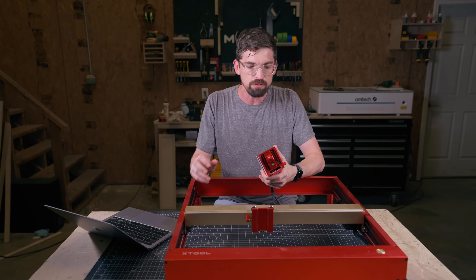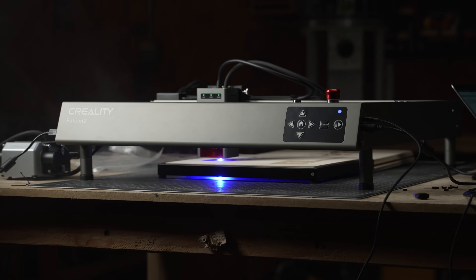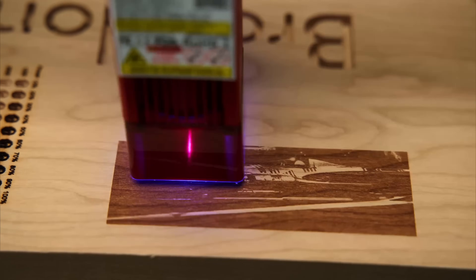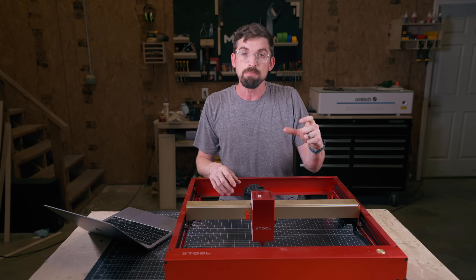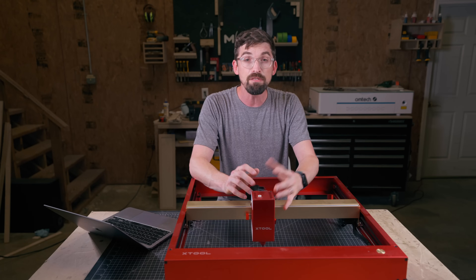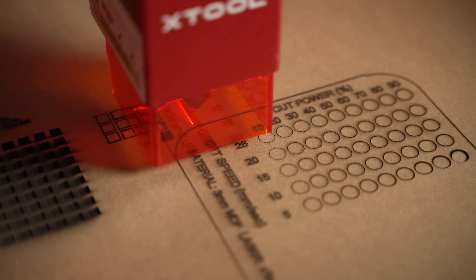You can get these machines anywhere from about 5 watts all the way up to 40 watts. Once you're hitting the 20 to 40 watt range, you're going to go over $1,000. I really think 10 watts is a pretty good sweet spot — if you want to do a little bit of cutting and mostly engrave, you can keep it at the lower end in terms of power. As you step up in power, you're adding more diodes together and the beam size gets a bit bigger, so the 40-watt laser diode is not going to give you as fine an engrave as a 5-watt diode. But if you want to cut, laser diodes can definitely do it. I've got links to tons of reviews in the description if you actually want to see tests I've done with these machines.